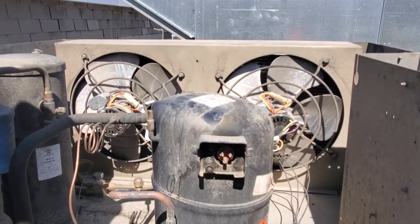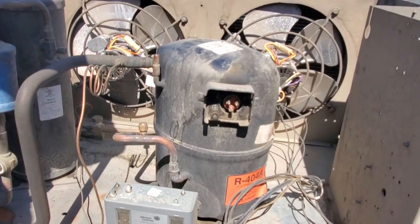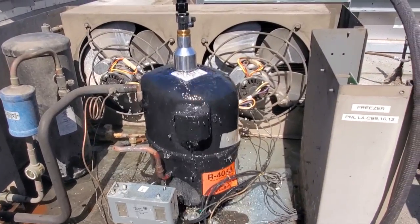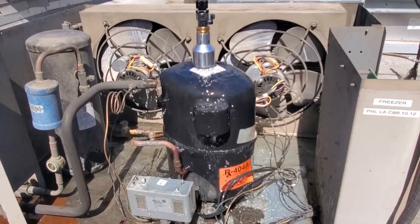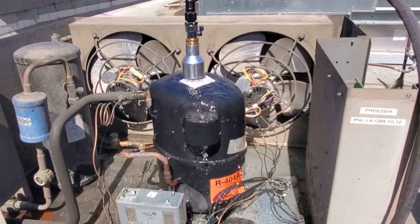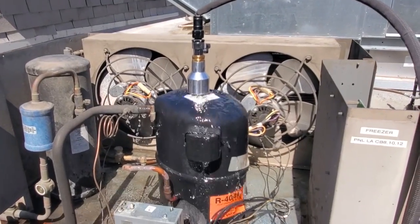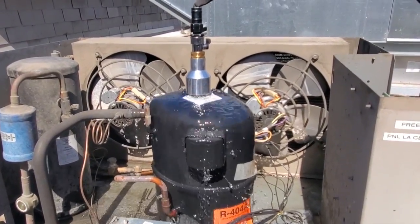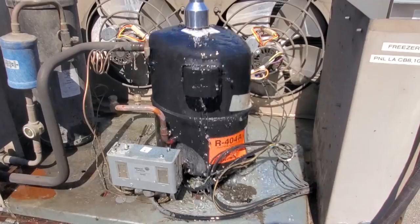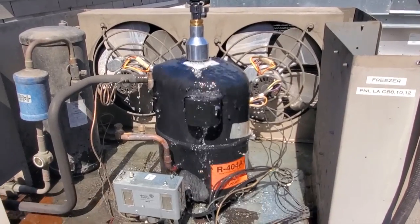We're going to try to cool this compressor off and hope it resets. In the meantime, we'll change that condenser fan motor too. I found this new product on social media — it's called a cool presser. I'll put a link down in the video; I have no affiliation with them, I just bought one. They don't even sell them at supply houses yet — someone made them themselves. It's pretty cool. You can always cool off a compressor yourself, but the cool thing is it's magnetic. There's a big enough gap with the magnets in the middle so that water flows over the compressor to reset the thermal overload faster. We're going to let this run for about five or six minutes, cool that compressor off, and then check if it reset.